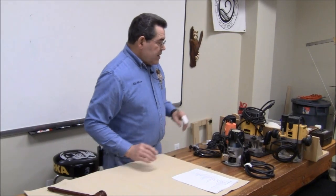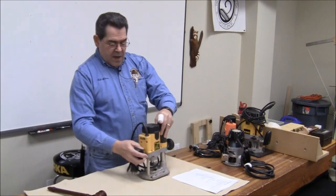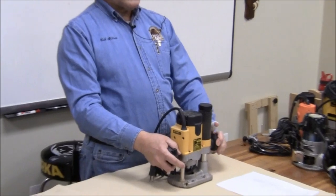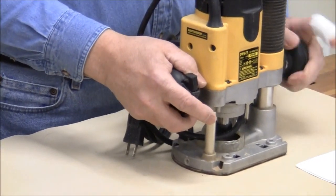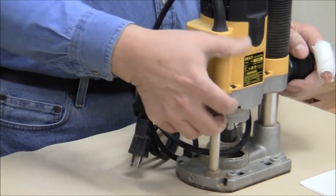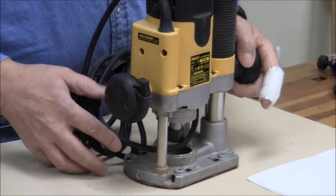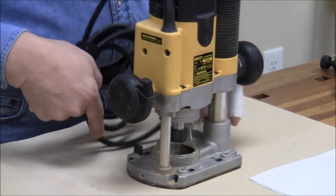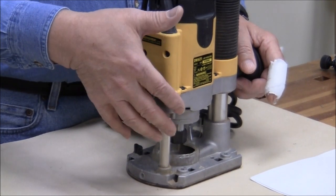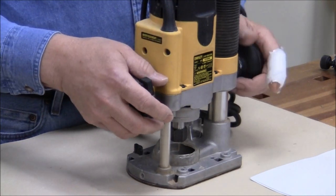Why would you have a plunge base? Two of these are plunge-base routers. Basically, it allows the motor to slide up and down, and then you can lock it in place. This one uses a handle — by twisting it. Some of the others will have a lever that you operate with your thumb to lock the plunge. Some lock when you press the lever, some unlock when you press the lever, so they lock routinely any time you're not touching them.